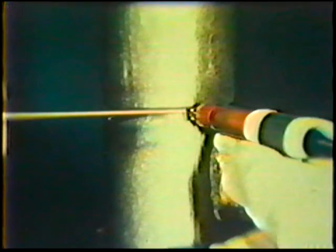For the second fill pass, the torch is aimed at the upper toe line, and the filler rod is angled in a similar manner to the previous pass, except that it is directed towards the upper bevel. The weld is deposited with the same technique as before. Be sure to fuse into the second bead and into the upper joint bevel. The second and third pass together should form a flat to slightly convex face. The fourth and fifth passes are deposited with the same angles and techniques as before. The finished weld should completely fill the joint and form a 1/16th to 1/8th inch face reinforcement. The weld should fuse into both beveled edges with no undercut. Inspect the weld and then continue practice.